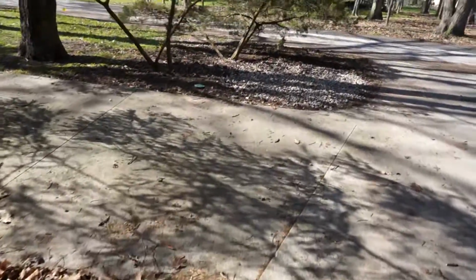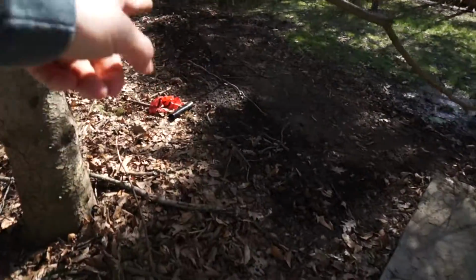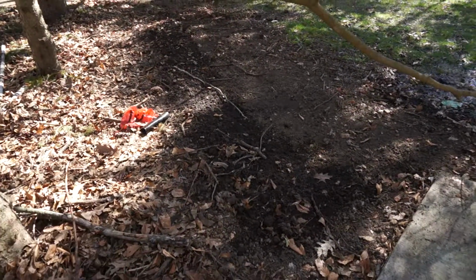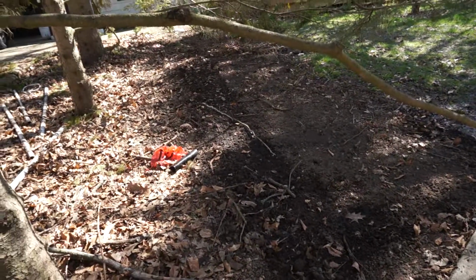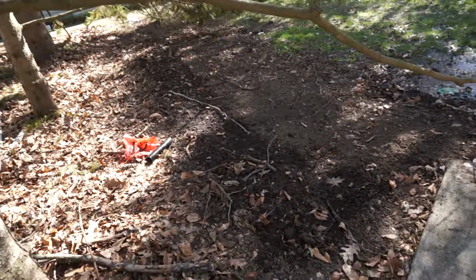As long as I'm not flooding the street, the second biggest issue, beyond the gravel, is the fact that I have a pretty flat lot. So when I dug all of this out all the way to the house, when it filled up with water, because I had nowhere to go because I had it sealed off, it was flat. The water was even with the ground, telling me that basically from here to there is a flat area, so there's no incentive to drain. The water is supposed to come out at grade,